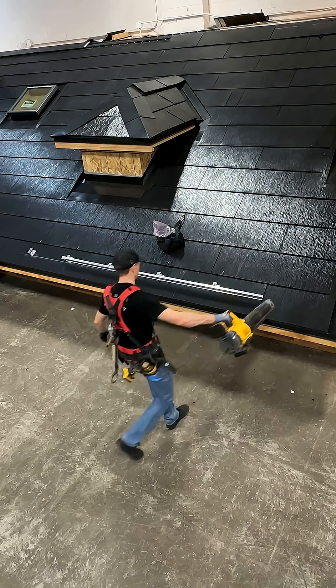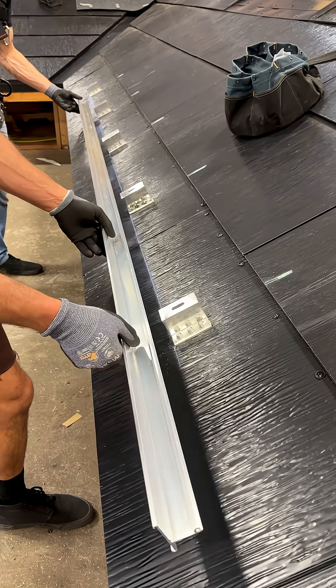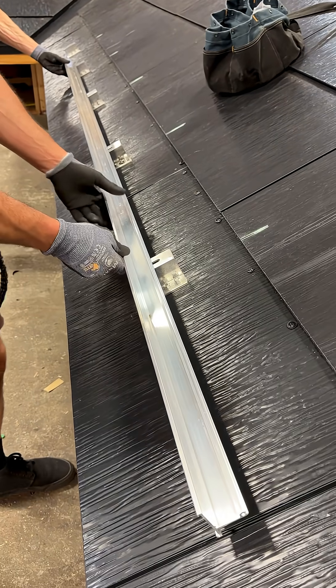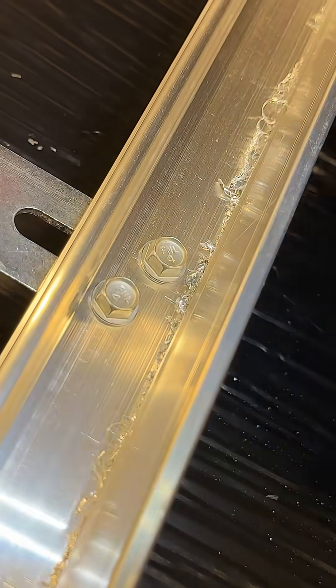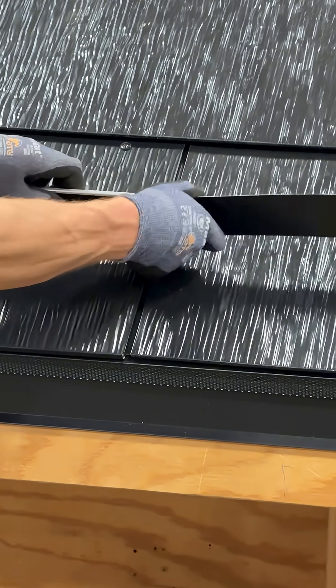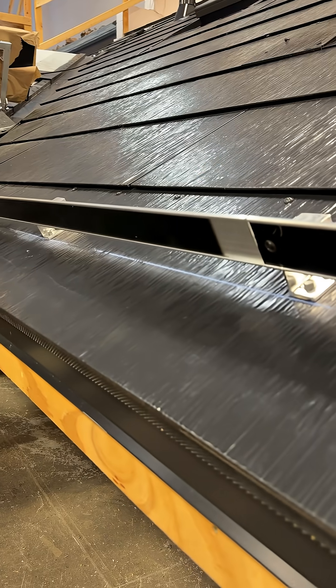Be sure to remove all metal shavings off the roof to prevent rust marks from appearing on metal tiles. Mount the snow fence on top of the Versa brackets and secure with two self-tappers per bracket. Ensure each fence has a length of color-matched flat stock installed and secured to the face prior to adding additional splices for the remaining fences.